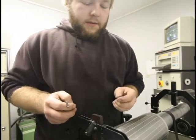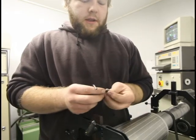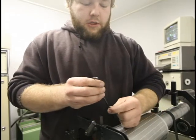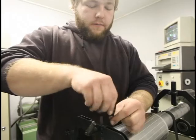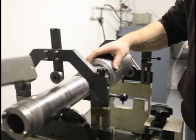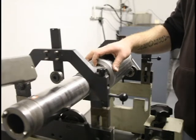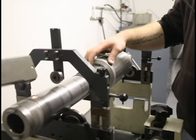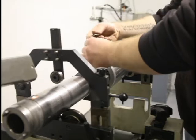So I'm 4 grams out in the back. I'm taking this set screw — it's about half the size — so it should bring me back within tolerance again if I'm changing it from the front. It told me to take weight off at this certain point at 255 degrees, so I'm taking this screw out and moving it 180 degrees to compensate that weight and it should bring it down.